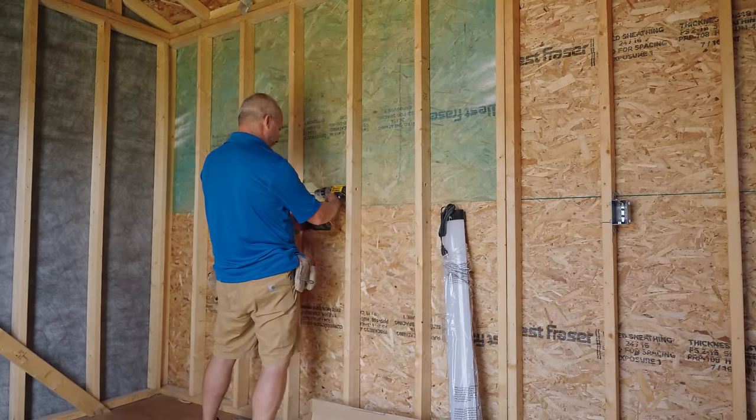So we're gonna use polyurethane sealant. Don't use silicone. Silicone will break down if it's sitting in any water. So if you're waterproofing something, you're doing it because you expect it to get water, it means it's gonna fail. So use the polyurethane, and now we're gonna pump this in all along the top and around the sides